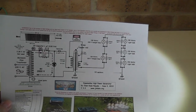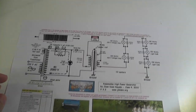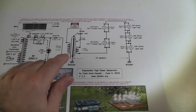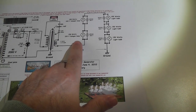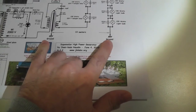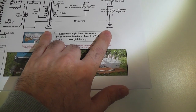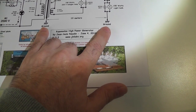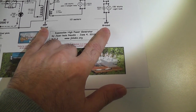What we are going to attempt here is we are going to neglect in the first phase power input. We are going to take this one away and replace it with a pulse generator. I will use my example of a capacitor — how fast can I charge a capacitor — so that gives us that benchmark information. Ground to ground I have more than 10 meters, and that should be good. I measured previously the resistance between my network and the single rod; it was around 9 megaohm.